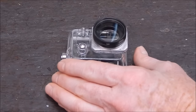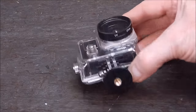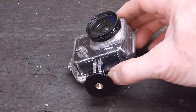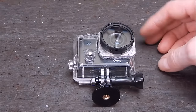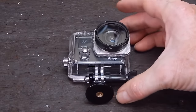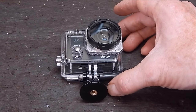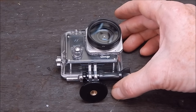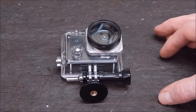Overall it's pretty good. I'll put the camera in so you can see how it fits — here it is with the camera in it, and you can see it all worked out nicely. Even though some of your backyard casting aluminium might not be fantastic stuff, it's still good enough to machine and play around with — it's better than nothing. In this case it came up okay with some high speed steel. You can still see some machine marks on it, but I could put a bit of black paint on it and you'd never notice the difference. There is a big difference in the metals you come across during backyard casting. Take it from me — if it's from a lawnmower, forget it, not unless you're a masochist. It is absolutely the worst aluminium in the world. See you next time, cheers.